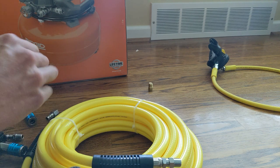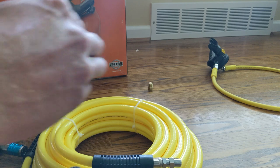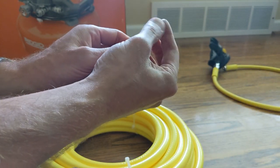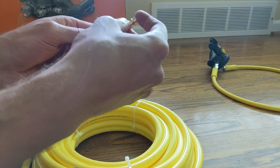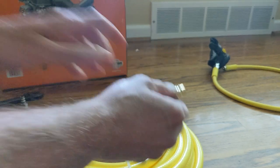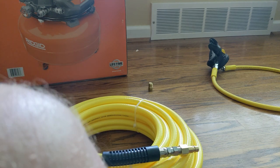The Cressi regulator is a very nice low pressure regulator, which is why I went for this, because it'll run at 75 PSI, which is fantastic, right? Any air compressor can more or less achieve that. You can see me struggling here. I'm putting on that final high flow fitting, dialing that down, and then that goes right into your filters.